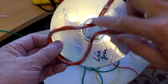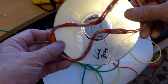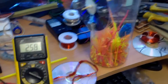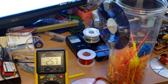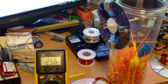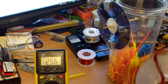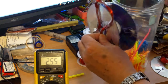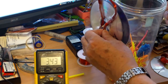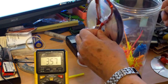I probably need about 500 turns of wire to make this work. Since I made it I am just going to show you what it can do for those that are interested in making this type of thing. You can see on the meter here 2.57 volts — that is from the charge held by the capacitors. I am putting the coil flat against the magnet plate and you can see with a good turn it jumped up to 3.5 to 3.6 volts.